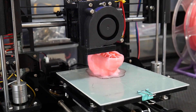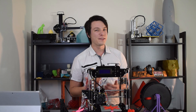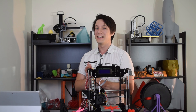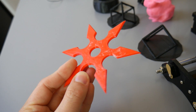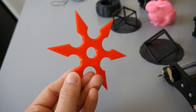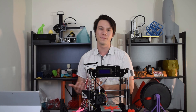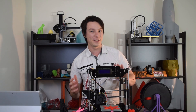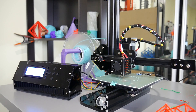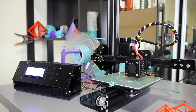For a first 3D printer, the Start has a lot going for it. It's super cheap, which makes it less of a risky purchase if someone decides the hobby isn't for them. Assembly is fiddly but not much worse than a big Meccano set. And it has a safe 12 volt DC adapter, so you don't have to worry about mains voltages. However, it's a PLA-only printer and part quality won't come close to a more rigid machine with higher quality motion components. I'm probably more frustrated than I should be about the incorrect firmware setup — it's such a simple fix to overlook. It may be caused by Tronxy using the same firmware from a different printer like the X1. Personally, I believe the X1 is a slightly better design due to aluminum extrusion versus laser-cut acrylic, but it's definitely not perfect either.